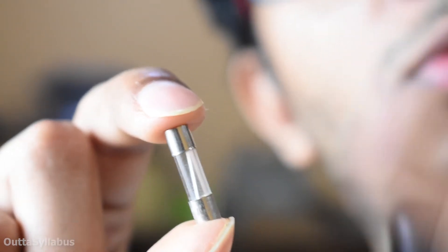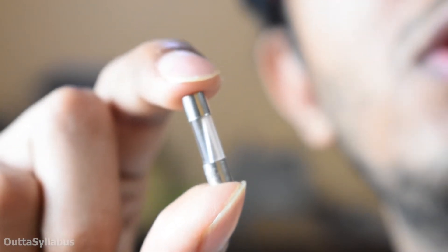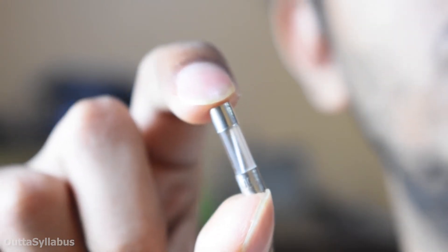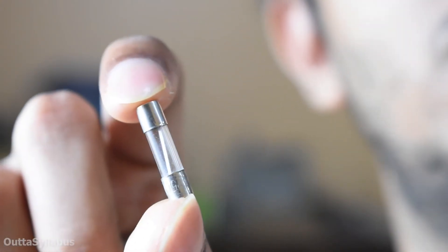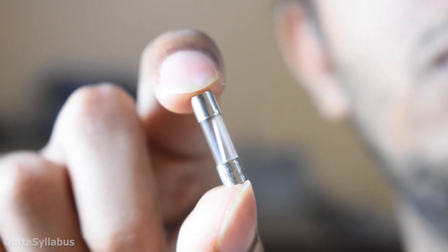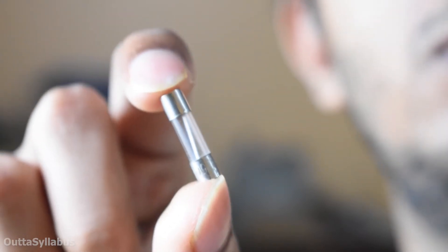There are other kinds of fuses which have a single strand of wire. Those melt pretty quickly — that's why those are called fast fuses. Power strips should have fast fuses. But probably when changing the fuse I didn't look, and instead fitted the slow one. It will let your components die and then it will die. Now I feel how much of a moron I am.